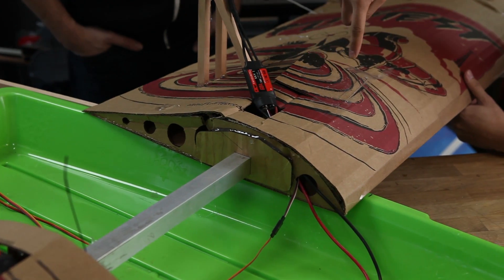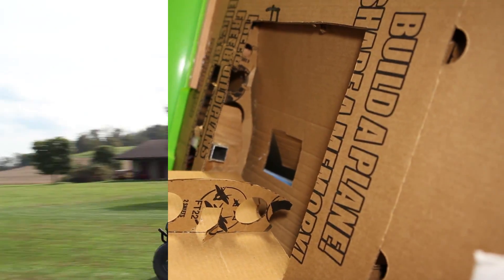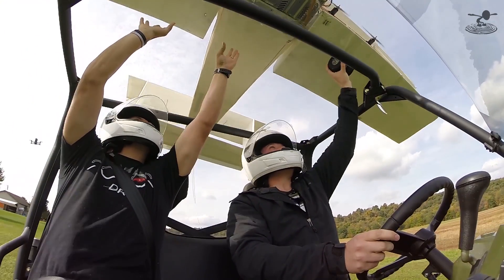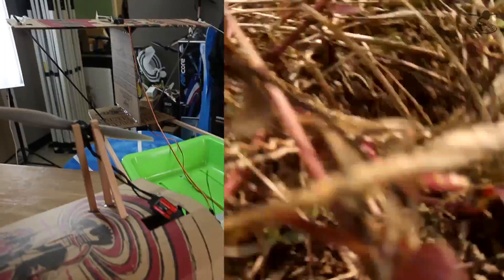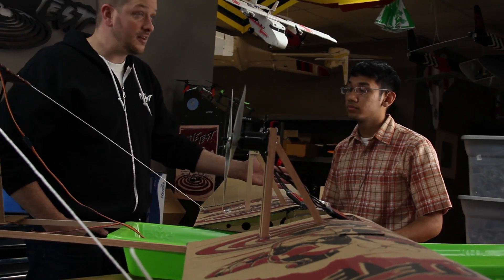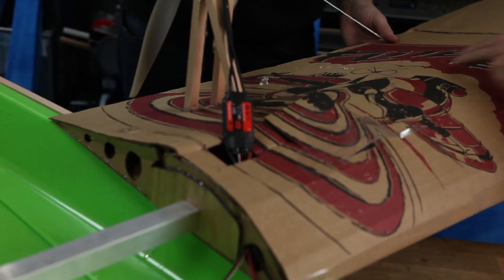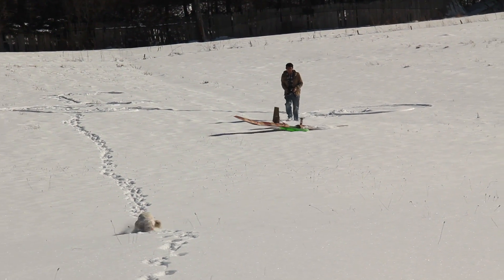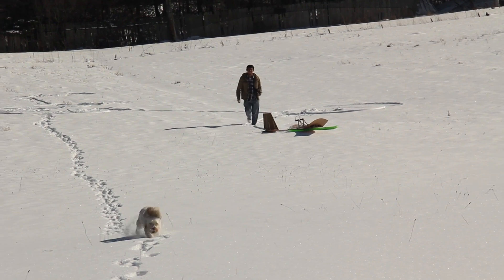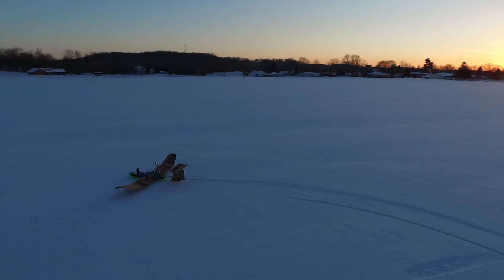This is a terribly irresponsible thing to do, but cardboard is so strong it worked just fine. This spar only goes into the wing about this far — it does not go any further than that. That's a terrible way to design an airplane. That spar is from the microwave plane — I just cut off the small usable straight section and it's in the wing now. Generally, the further out you go on the wing, the less stress you have there, so by extending your spars further you increase strength exponentially. The first time I ran this around, it would dig in and the cardboard got all wet — cardboard and water don't mix. So I put little skids on it, and with differential steering I could steer around the snow just fine.